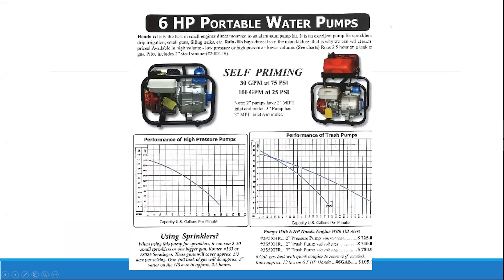There are a lot of pumps out there, but you don't need a huge pump. Talking about gallons per minute at certain PSI — that's what you're looking for. You don't need a huge amount of horsepower. Thirty gallons per minute at 75 PSI would definitely cut it; 25 PSI, depending on the size of your system, might be enough.